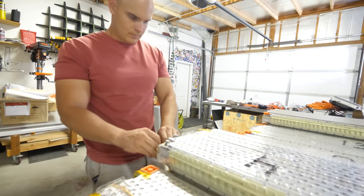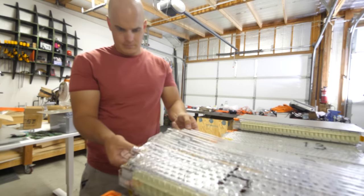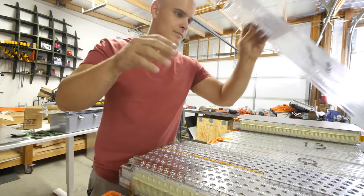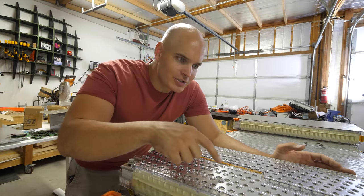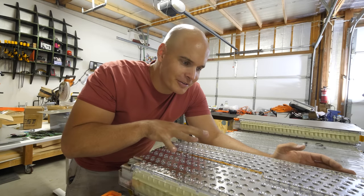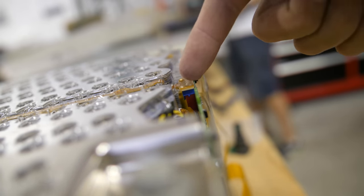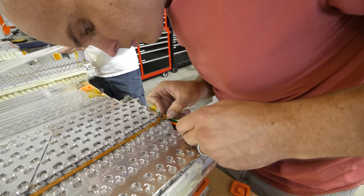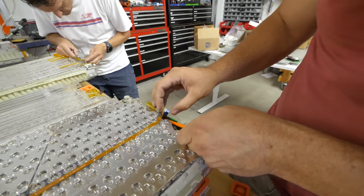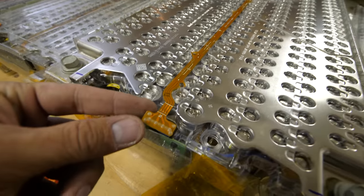The yellow tape is called Kapton tape, and it's relatively common, used across electronics and cell phones all over the world. It's holding the two plastic casings of the battery together. That plastic covering is just protecting all the individual batteries and their connections up top. If I set something metal down on top of this right now, boom. This is the little cell ribbon that comes to the top of the board, and we have to reach a little pry tool inside of there to disconnect the blue part from the red part. These plugs and ribbons are extremely fragile, and we need them, so we gotta be careful.